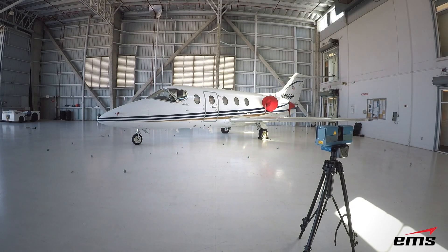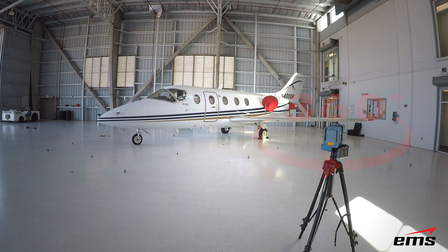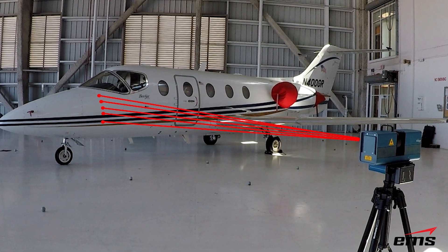Let's start and talk about how the Surphazer 3D scanner works. The Surphazer is what's called a hemispherical scanner, meaning the whole unit or body rotates 360 degrees. In the center there's a mirror on a 45-degree angle, and the laser is actually inside the unit, shot out towards that mirror. The mirror reflects the laser out, pulsing one point at a time, until it hits an object and returns to the sensor, measuring the distance.